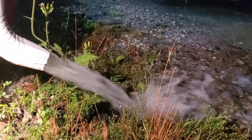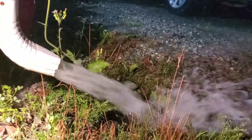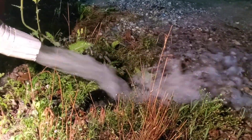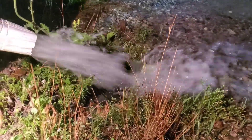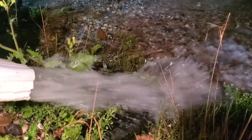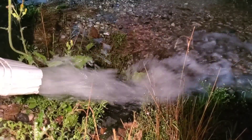It's a thunderstorm — we have many each year. These thunderstorms are the ones that clean out a downspout system, including an underground downspout system. This is a good example of why you don't want your downspout dumping water next to your foundation. It doesn't matter if you have a crawlspace or a basement — this is how you end up with water inside. The water's coming down with high volume, shooting out with such force and velocity — such pounds per square inch.